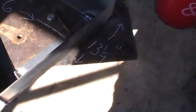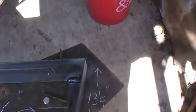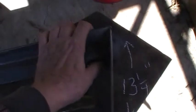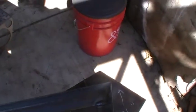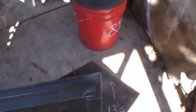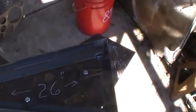My treads over here, as you can see, are not 11 and 5/8 — I made them 13 and a quarter. The reason is I'll have handrail verticals that come up through here and here on every tread. I'm going to use 3/4 inch Schedule 40 pipe for those, which is 1 inch and 1/16. This is 1/8 inch angle iron — you don't need it heavy, it's lightweight since you only have one body on there at a time. That much will actually be under the next step as you go up, so you have to take that into calculations when laying out your stair treads.